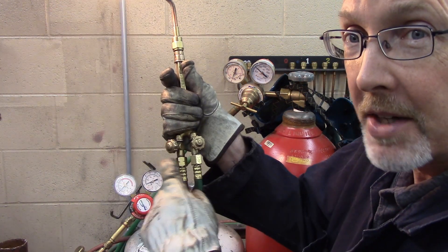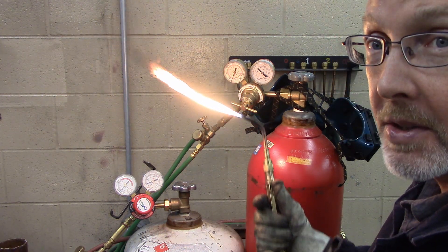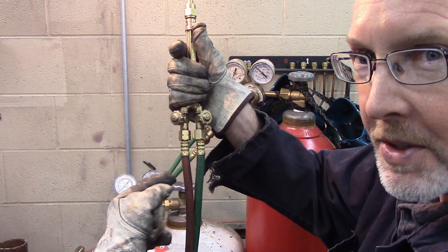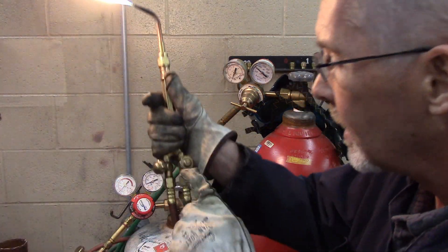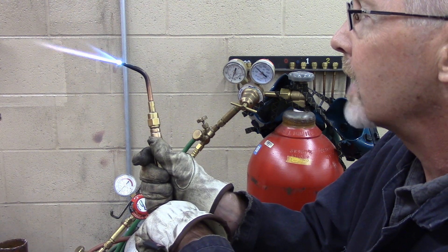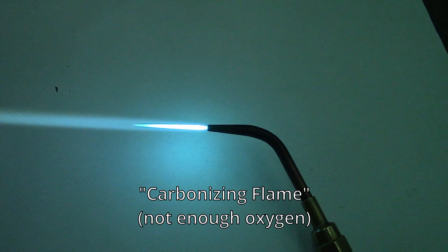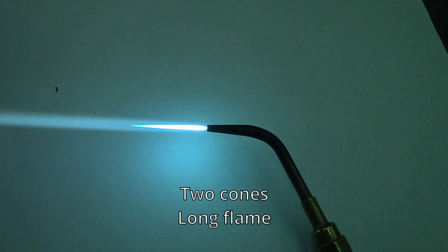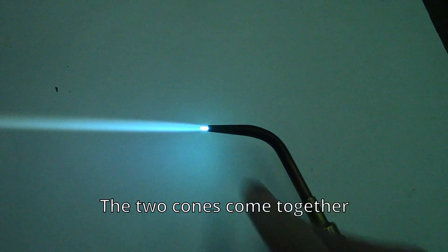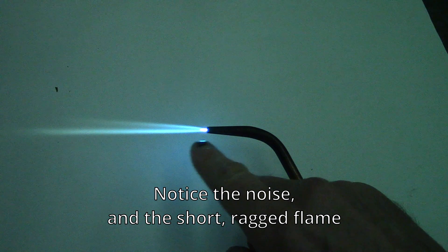You can see it going. I'm going to adjust this red knob — either less acetylene or more acetylene — until the smoke just disappears. See all that smoke? Once the smoke is gone, we're good. Don't mess with this once the red is set to no smoke — leave it. Now we go to the green hose, the oxygen. I'm going to crack that open slowly. Not enough oxygen is a carbonizing flame — it's a lower temperature and it's going to add a lot of soot to your weld and make it brittle. Neutral flame is the one we're shooting for — that's the perfect burn and the best for your weld. Too much oxygen is an oxidizing flame — it adds oxygen and will make your weld porous.